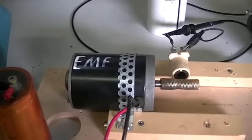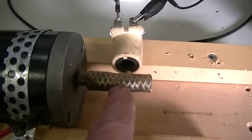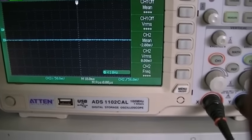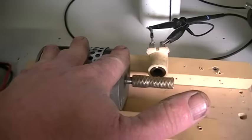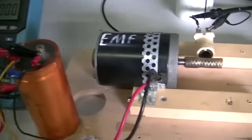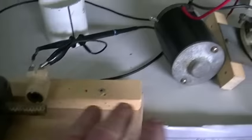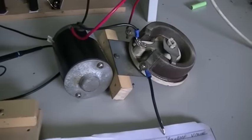The engine RPMs will be monitored inside this clear coupling tube. I have a flat permanent magnet pushed in there with a north and south running past this coil. This coil will give us a frequency value on our scope and we will be writing that down as we go. The first test is just the motor running freely by itself, which should produce the greatest amount of back EMF once it is up to running speed, and our power draw will be the least. Once we have those numbers we're going to couple this motor back up to the unit and use that motor as a load by way of our big rheostat.